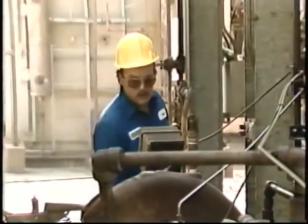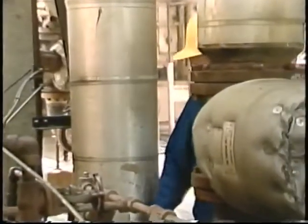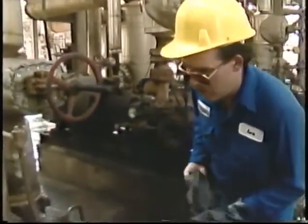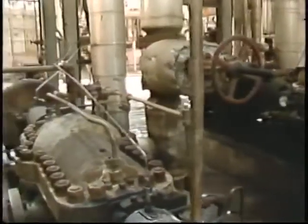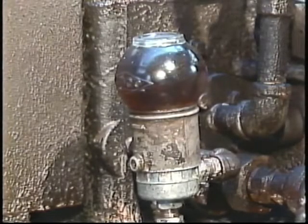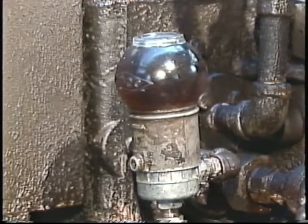In order to keep the turbine running the way it's supposed to, it's important that you perform these checks properly. During these inspections, you should observe whether the turbine appears to be running smoothly and whether the values of the readings and overall operating conditions are normal. You should note any unusual noise or circumstance associated with the turbine, its auxiliaries, or the driven equipment. Checking out possible problems early is a good way to prevent more serious trouble later. The operator shown here is checking the level on a constant level oiler to determine if there's enough lube oil in the oil reservoir and if the oiler is working properly. The level in the glass is slightly lower than it was at startup, which is generally a sign that the constant level oiler isn't plugged and is maintaining sufficient lubrication. Adequate lubrication helps keep the bearings from overheating.